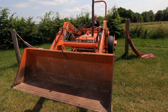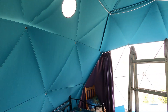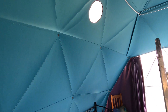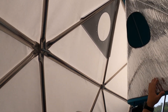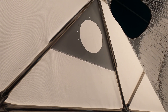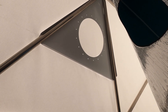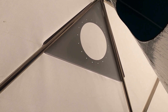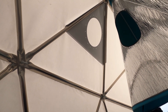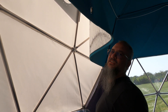I have the worst job — you know how hard it is in here? It is really hot. We've already put the insulation in so we're going to need to take away this layer of insulation and move the bed so we can get in there. Now we can access underneath the insulation, and you'll see what we did before was put the vent plate in, which comes with the solar vent if you're buying through TrueDomes. The vent plate has got holes in it ready for the screws to go through from the solar vent on the outside, and it fits perfectly in the triangle giving it something to attach onto. But you've got to do that before you put the cover on — that is essential.